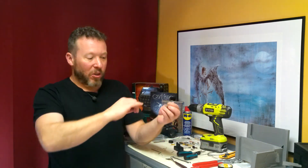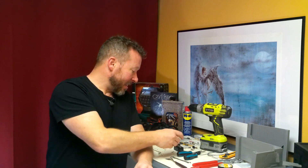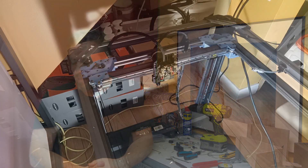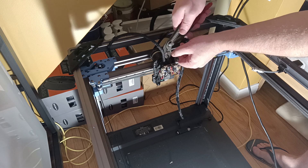So I took that little set screw out, removed the press-in nozzle. And I hope I can modify this hotend to take the hardened steel nozzles by threading it — like I did in the other video, but this time with the right tools. Almost forgot — this is how stuck filament looks in the extruder after being chewed on all night. And then there's another issue.